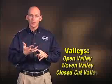Now, let's review proper procedures for flashing in valleys. Valleys are one of the areas that true professionals take their time in doing right. The average valley gets loaded up with almost a small river of rain and becomes really backed up with ice and snow in your colder areas. There are three methods for installing valleys: the open, woven, and close-cut methods.